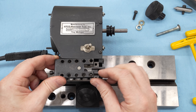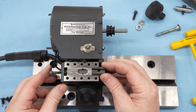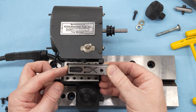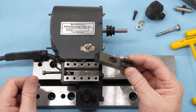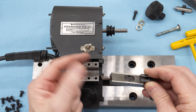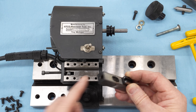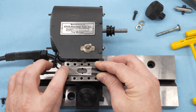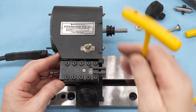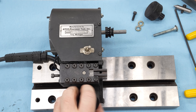Opening this up: it's just a cavity that has been precision ground, and the lid has been precision ground for the fit on top — everything fits with as close to zero clearance as possible. This is an incredibly tight fit. If you get a single piece of grit under the lid or down in there, it will lock up solid. There are some passages for oil. There is nothing to adjust the fit — this is precision ground to fit, so if it ends up undersized or the slot is oversized, I don't think there's any recovery. There's a spring and a little push rivet so the screw has something to bear on, and a little lever on the bottom that pulls it back against the spring pressure to release it. It's a very simple mechanism, just very precisely made.